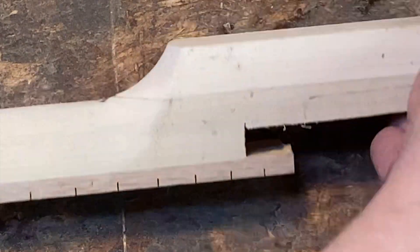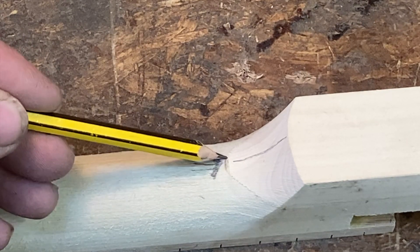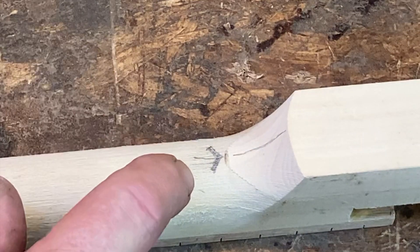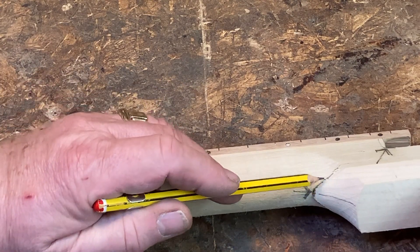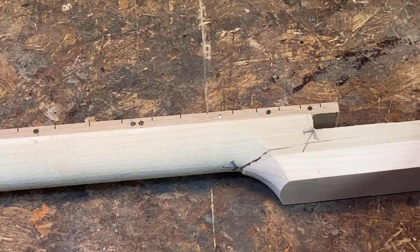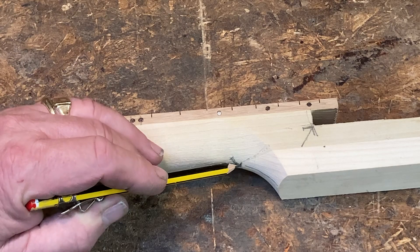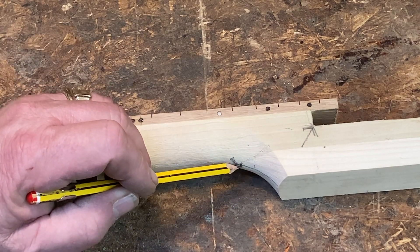An interesting thing to note - if you can see the glue joint, it's not failed on the glue joint. But if we turn it over and look here where I put the arrow, this is a junction between the back strap and the main neck. You can just see the start of the glue joint, and if I bend the neck down you can see it's opening up - that's where the crack started. It propagated, it grew from that point. Interestingly, it's failed here along the glue line but then started running off into the main part of the neck.